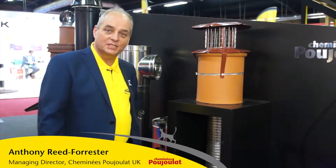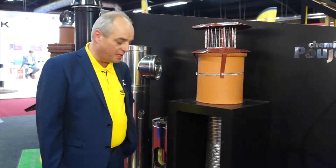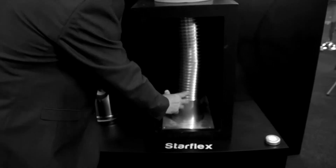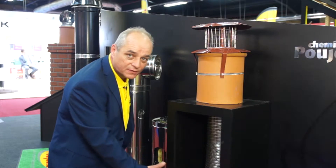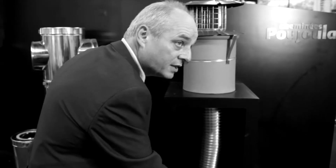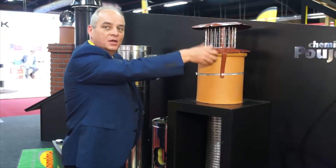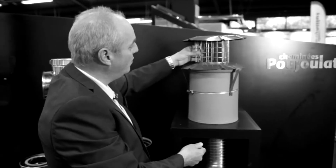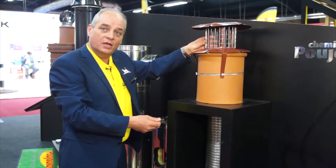Starflex is basically a system to reline brick chimneys for when you want to install your stove to an existing brick chimney. We start with the adapter on the closure plate down here — there's a push-fit adapter that allows you to push it on but screw it off, so you've still got access to the adaption even through the closure plate. Above you've got your traditional pot where we have a push-fit adapter that pushes onto the flex but for maintenance can be screwed off. We've even allowed the mesh to be an adaption — it can be put on or taken off at any time.